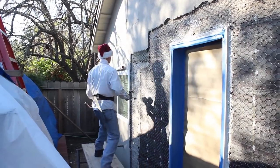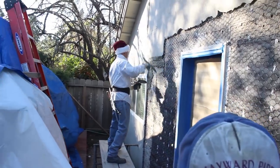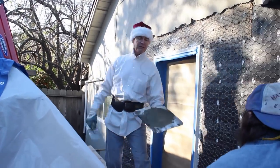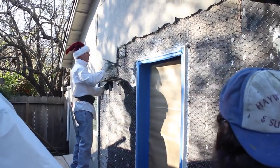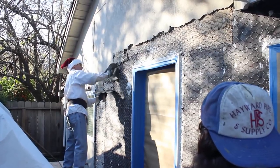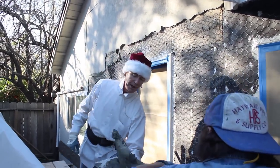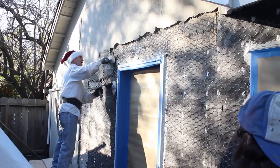I recommend you always do your tops first. When you're this thick here you've got to have time for it to set, otherwise the top will fall and you'll lose that top seal — that's not good. This part from here to here will take about a wheelbarrow of mud. It goes from seven or eight inches down to two inches — nothing we can't handle.